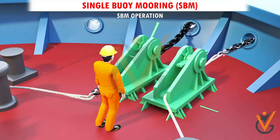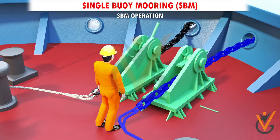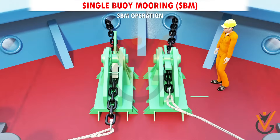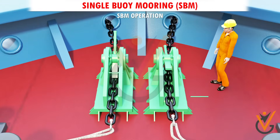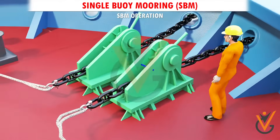When the chafing chain reaches the chocks, it has to be lifted and hove carefully with extreme caution, so no excess weight is coming on the pickup rope. When the chafing chain passes through the bow stopper, allow a few links to pass, and drop the tongue hinged bar in place, and secure it with the pin.